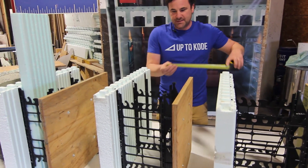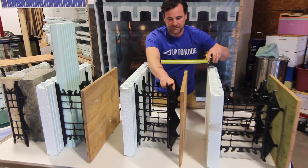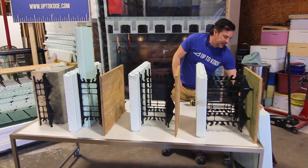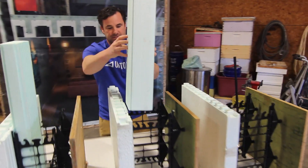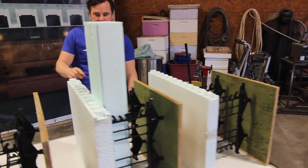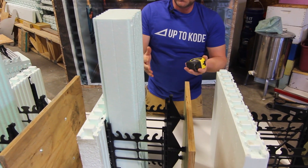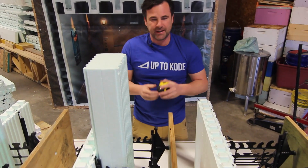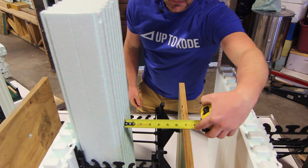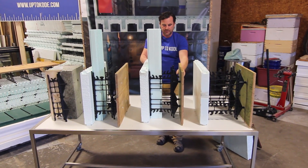The next step is you just keep increasing your web size. With an eight-inch web, adding two and five-eighths for the multi-link tie, you now have a ten and three-quarter inch wall. You can add a four-inch insert, giving you an R28 wall assembly — the R-value is plus or minus, just a roundabout number. And you maintain that six and five-eighths, roughly six and a half inch wall of concrete, depending on whether you count the outside or inside of the fin.